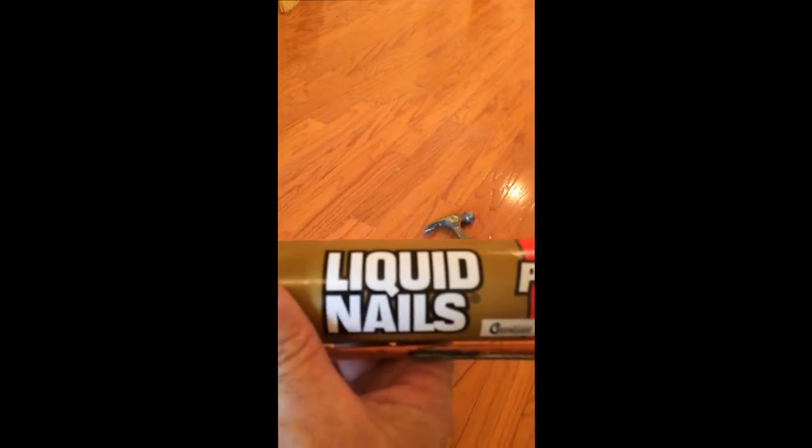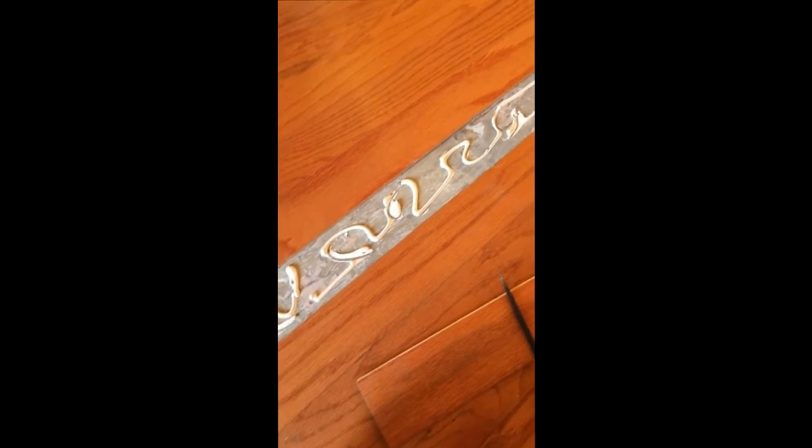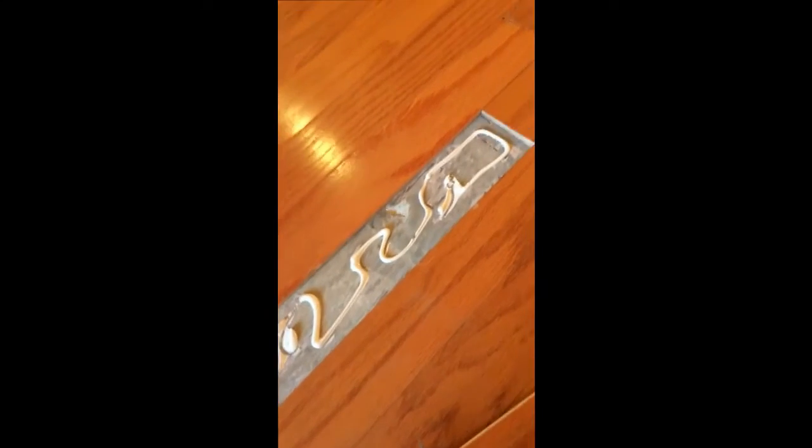Getting down to the very last piece. These are the boards that I installed. What I didn't show you is how I glue it down. You can see I've already put a little bit of glue down in this opening. Here's what I'm using — everybody's heard of liquid nails. It's construction adhesive, liquid nails. You just squirt a little bit of that down in there, and when you tap down the board, it kind of spreads it out evenly.